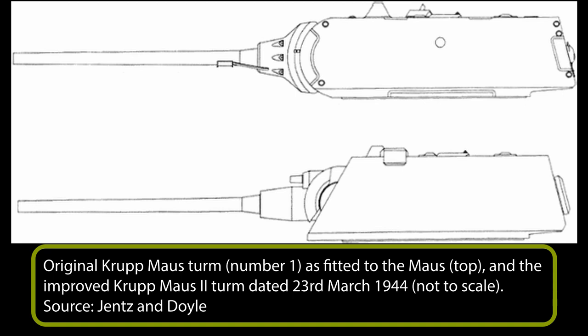The heavy armored side plates could have been scrapped from the design to save weight and make the sides of the turret thicker to match the protection levels of the hull sides. But instead, a vehicle whose armor everywhere else was all but immune to the majority of Allied tank guns was remarkably vulnerable on the turret sides — a flaw identified already on the Tiger II. It could be questioned why the rear armor was 150mm thick on the turret, but heavy armor on the turret rear obviated two problems: reducing the chances of mistaken friendly fire from behind, and adding weight to help counterbalance the enormous weight of the front of the turret.